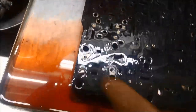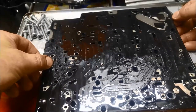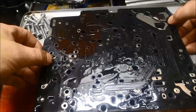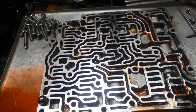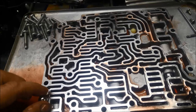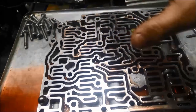You'll notice that there are little check balls and valves underneath this plate, so be very careful when you pull it out — especially if you don't have a shop manual. Very carefully work that gasket loose, especially if it's stuck. You can see the little plastic balls there — sometimes they do wear down, they're quite small. Apart from that it looks pretty clean. You've got a little valve here, a ball and spring there, a little bit of muck, but it looks like it's not too bad.